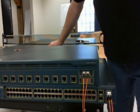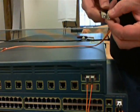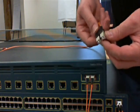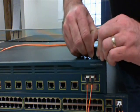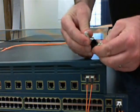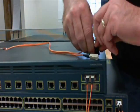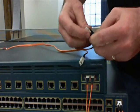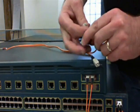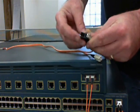Another problem you may run into is a different type of holding bracket on the SC side. In this case, the split is on the side of the holding bracket, so the way to get the fiber out is to gently work it out on each side. On the other fiber, carefully note the orientation so that when you pull it out, you can make sure you're actually crossing the fibers and not putting them back in their original positions.